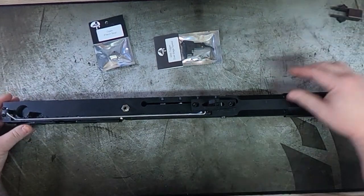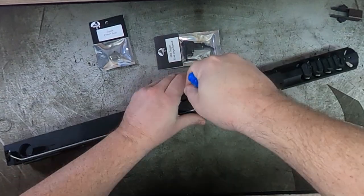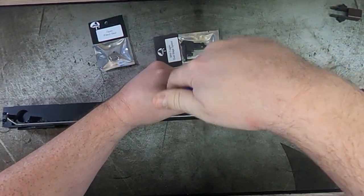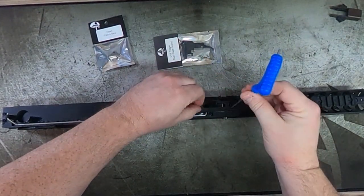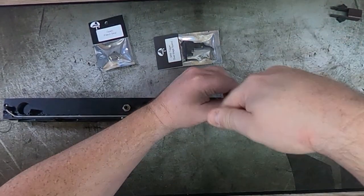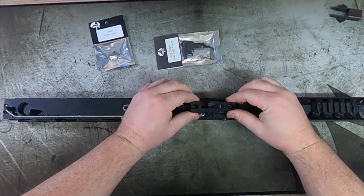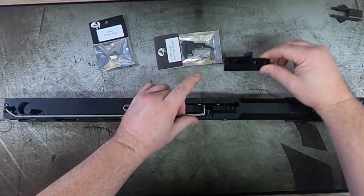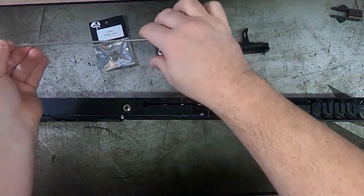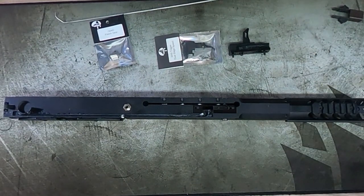Remove the safety catch first, and now we're going to remove the trigger box itself. These screws can be quite tough — they've obviously been put on there by the manufacturer. You'll also notice that these are in grooves; this allows the trigger box to slide forwards and backwards, and this allows you to set the height of the sear so you can customize it yourself for a harder or weaker break. Just move the transfer bar over — now we have access to the rear sear.